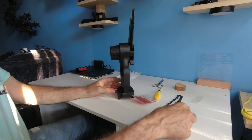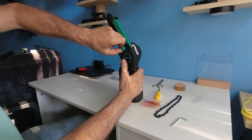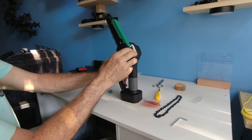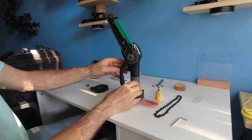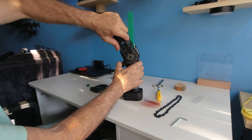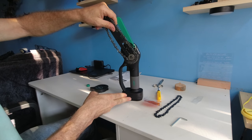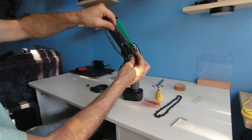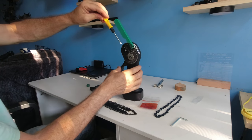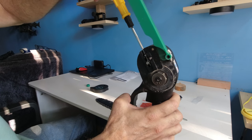You can tighten it up right there. When changing the chain, what you're going to do is take this knob — it takes off the cover shield. You take the cover shield off, then take the guide and open it up. But before you do all this, you want to make sure the battery is out. Then you simply remove the guide, and now you can see a close-up shot of where the screwdriver goes — that's where you're going to loosen.